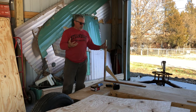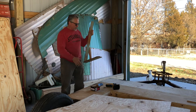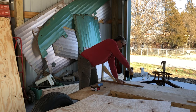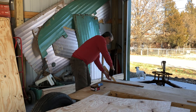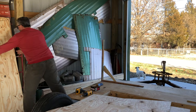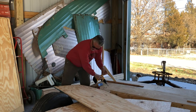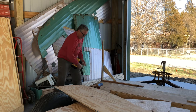We've got the floor put down, the frame is solid, and there's wood underneath to screw into — so it's time to put on the sidewalls we got cut out. One of the little tricks I use: I make this 90-degree square angle and put it right up here to the edge and screw it down. Then when I go to put on the wall, it'll sit right up against that. Now I'll take the piece we cut, put a couple of screws started in it — we've got about two to two and a half inches to work with there.